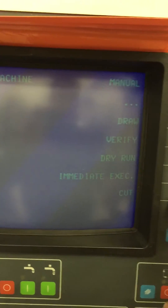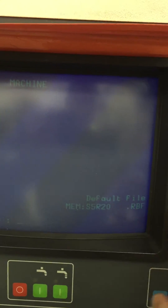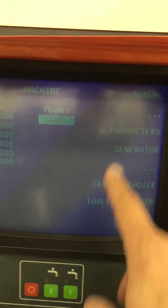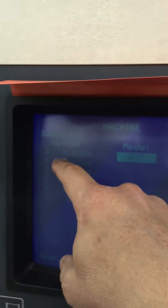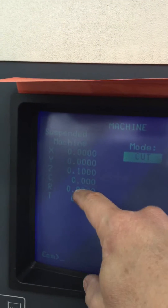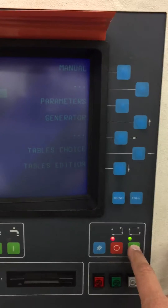We are now ready to go. Menu, machine cuts — remember our 5R20 program we edited, it's ready to go. It tells us our XY zero, we're starting at Z.1 above the part, and we can hit the go button now.